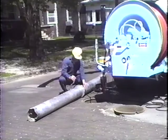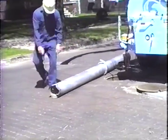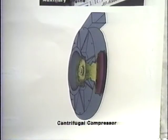Easy-to-handle over-center quick clamps allow for efficient coupling of the vacuum pipe. It is important to use the catch basin nozzle at the working end of the vacuum pipe — a serrated steel end with holes is by design, allowing air to be injected even when the end is submerged in water. The vacuum system on the Vector utilizes an air conveyance concept; it is not a true vacuum machine. The centrifugal compressor design needs air to move material. When the nozzle is submerged in water, a cavitation-type noise will be heard from the fan, and the system will only pull a column of water up to a limit. Consequently, it is of vital importance that the operator maintain the vacuum pipe nozzle above the water level.